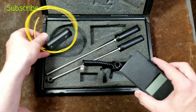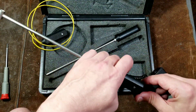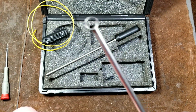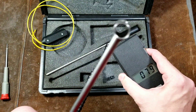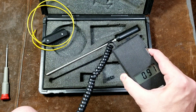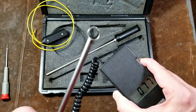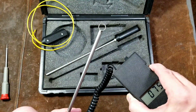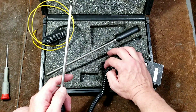Now let's try the air temperature probe. The reason I can't heat the immersion probe above 98 degrees is because the temperature of the human body is 98 degrees. And here's the air temperature probe — as I was breathing on it, what's nice is that since the wire is only four-thousandths of an inch thick, it's truly a high-response, near real-time measurement, and that's definitely a pretty big advantage.